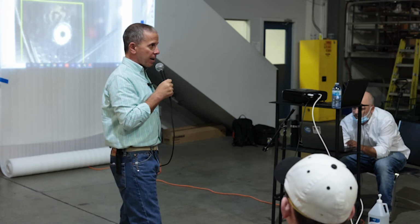I hate it because water is pretty much guaranteed to penetrate beneath that teak, because nothing really sticks to it for very long. Teak is a very oily wood, so getting bedding material to stick to it long term is very challenging. And any material is going to trap water if it is over aluminum and water penetrates beneath it. Now you've got a water trap. So I discourage the use of teak and other wood in contact with aluminum surfaces, painted or not.